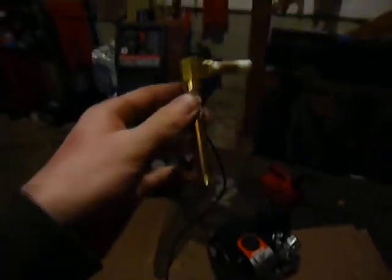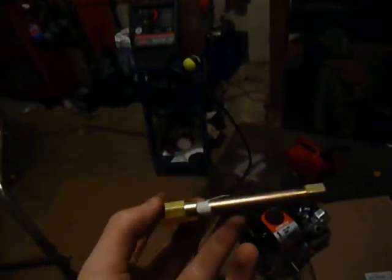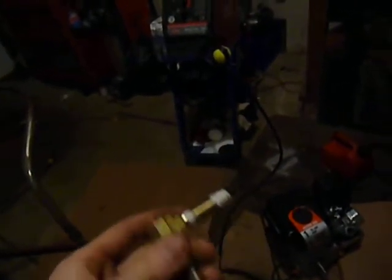The last modification I'm going to do to this motor — I'm adding this right here. This is all 1/8th pipe thread. I got a short piece there, a 90, and then about a 2-inch piece — I probably could have gone longer on that part — and then a cap. What I'm doing with this is bolting it right where the drain goes and angling it down towards the front, and that will allow me to drain the oil very easily and not make a mess.